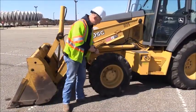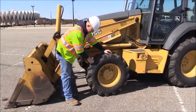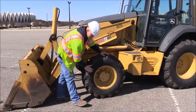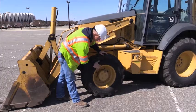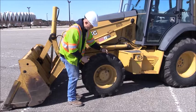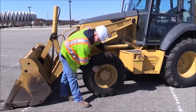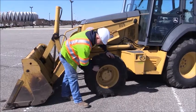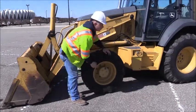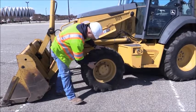Like on any other vehicle, we're going to check the tires. Looking at the tire itself, we want to make sure there's sufficient tread, nothing lodged in the tire, no foreign matter. Looking at the sidewalls, inner and outer, making sure they're not bulging, excessively dry rotted, or cracked. We're also looking at the rim — no non-factory welds, no dings, dents, or cracks. Moving in, we're checking the lug nuts on each, making sure they're in place and tight, positively mounting the tire and rim to the vehicle.